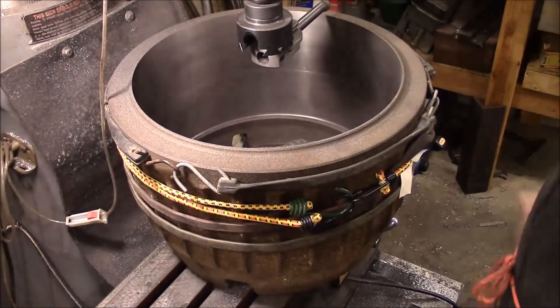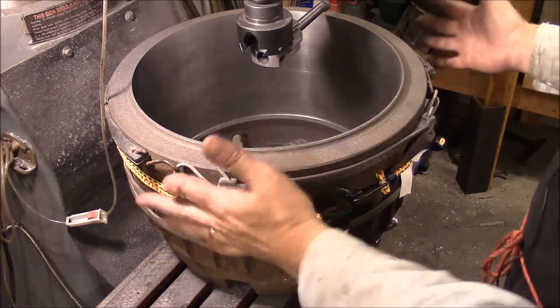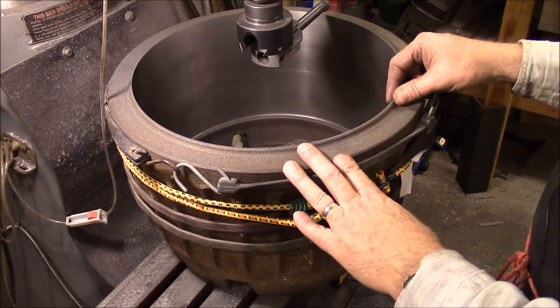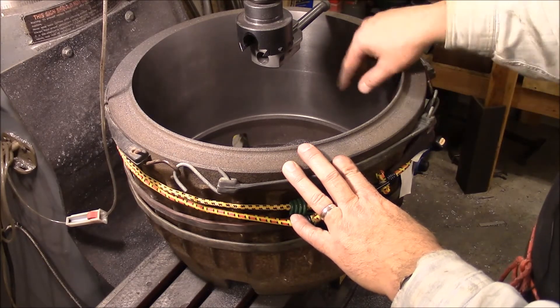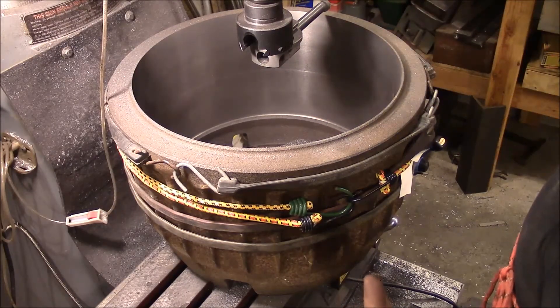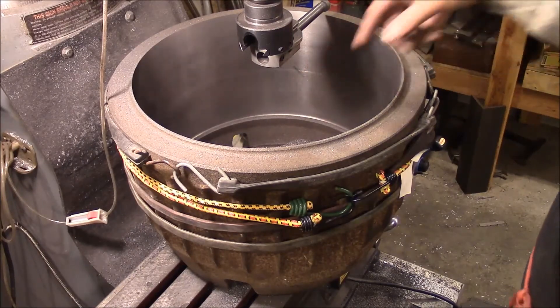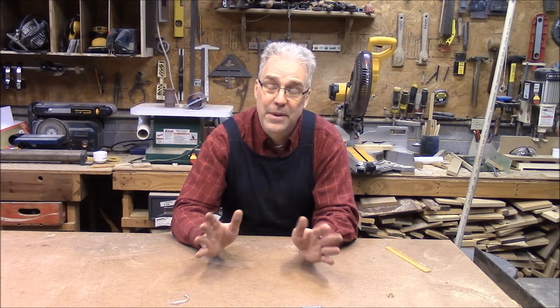After much trial and tribulation, I finally got it done. The main difference was putting the bungee cords on — that got rid of the ringing. It was ringing like a bell, and I think that was chipping the tip off my carbide, because before I couldn't get very far without having to stop and regrind. This one went all the way to the bottom. You can't even feel that tiny line with your fingernail — it's just really visual more than anything. So that's it. If you need to do a big drum, that should work for you. Thank you for watching — I hope you learned something. I certainly learned a lot.